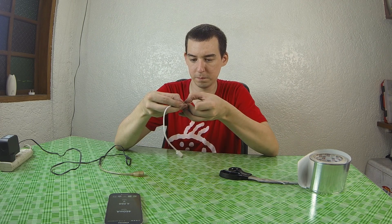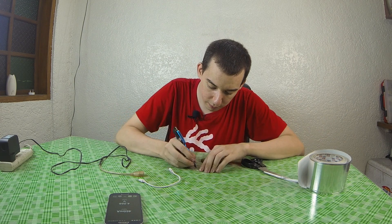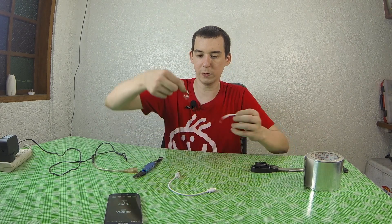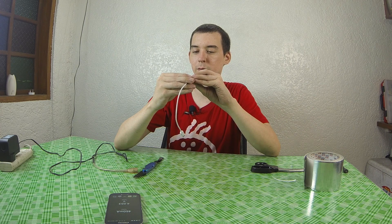That strip should work. I'll measure it to confirm it looks okay, then peel off the paper backing. I'll place the foil carefully inside the connector just to cover the two middle data pins, then push it down with my knife.